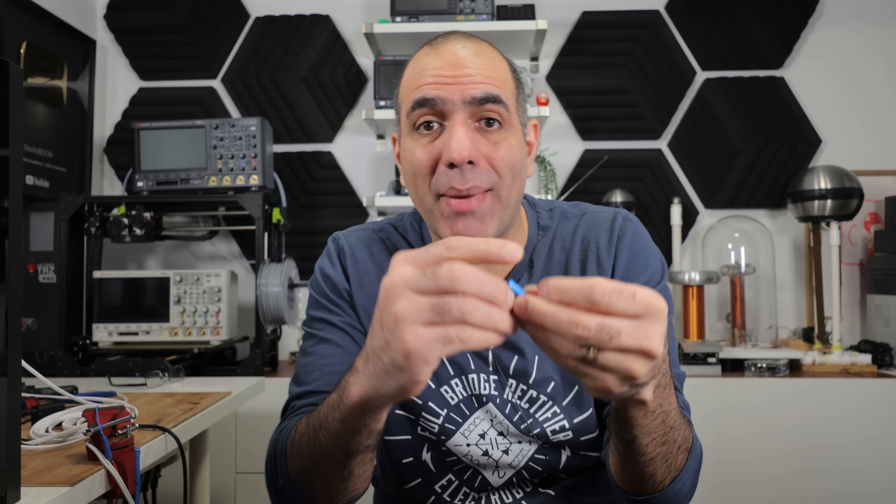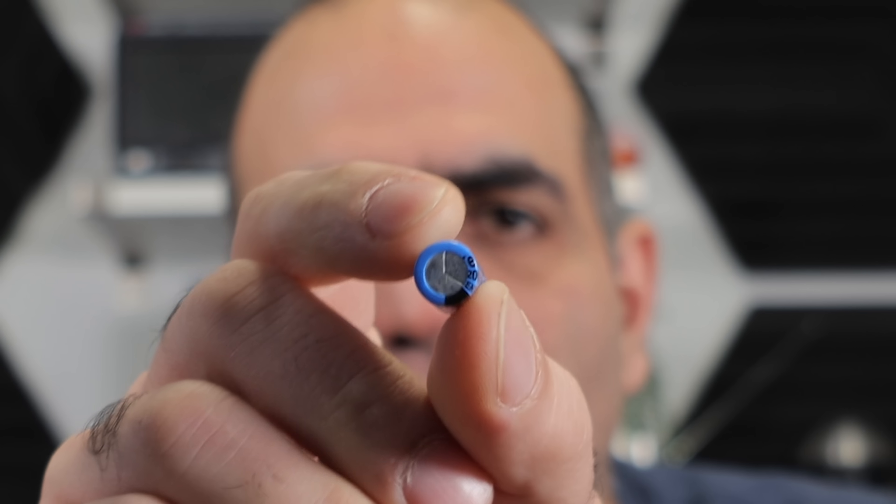It should be well cooked — WOW, SHIT! The issue with tiny capacitors is they don't have pressure release mechanisms, but bigger power capacitors do, because the explosion can be catastrophic. So they have, for example, these tiny grooves on the top plate.